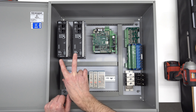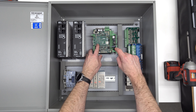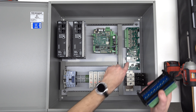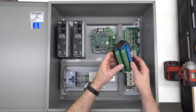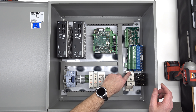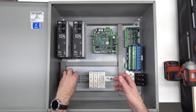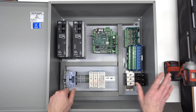Since I'm using ClearPath servos, I've got the power supplies for the servos here. I've got the motion controller — this is a Centroid Acorn with an optional board that interfaces to ClearPath servos. Underneath here, I've got a network switch that's required to provide Ethernet to the Ether 1616 IO expansion board, which provides more inputs and outputs than you can get on the base Acorn. And then I've got a couple of relay boards that connect to the Acorn and to the expansion to switch external devices, like the pneumatic valves to run the automatic tool changer and the purge, and to switch things externally like the servo brake for the Z-axis. Down here, I've got the power rail with the breaker, main contactor to turn the power on and off, power distribution, and the incidental power supplies for various DC things in the system, including the motion controller.